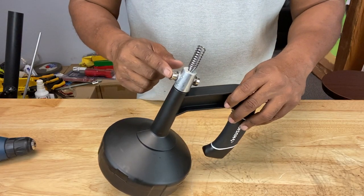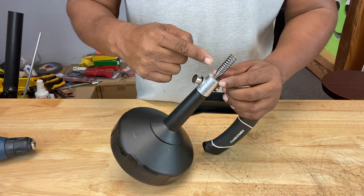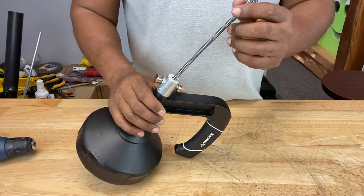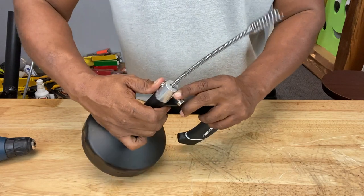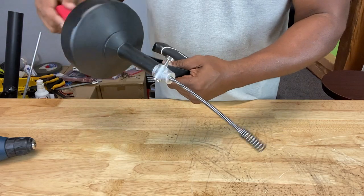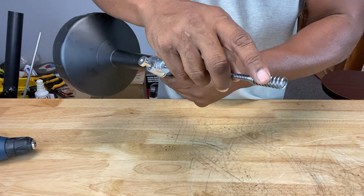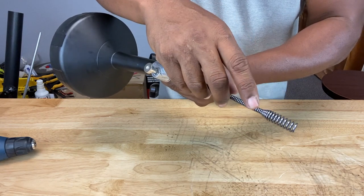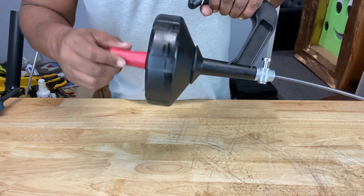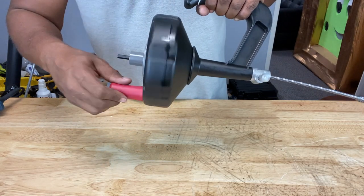This portion of the auger is the locking mechanism that you engage when you hit a blockage. When you're extending your cable into your drain and you hit a blockage, you want to engage this by pushing it down to lock it in. When it's locked, grab your handle and turn clockwise — this allows the auger bit to work on the debris, penetrate and grab it. Remember to work the auger back and forth: turn it clockwise when you first contact the clog, but also turn it anti-clockwise to work through the clog as well.